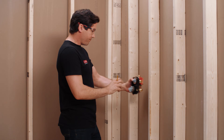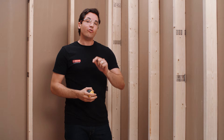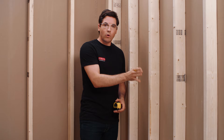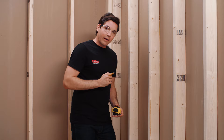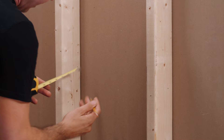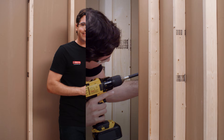So I'm going to have it right around in this stud bay here. Once you get that determined, the next important measurement is where we're going to place our blocking. The important measurement here is 2 and 9/16 inches from finished wall. I've got my rough framing, so you have to think about what other materials are going to be added to get to that finished wall depth. In my case, I'm adding half an inch of cement board and about another half inch of tile and thinset, so my finished wall depth is going to be an inch out from my rough framing. That means I want my mounting block to be an inch and 9/16 inch back from the front of my framing. I'll take my tape measure, measure back about 1 and 9/16 inch, make a little reference line, and repeat the same thing on the other side. Now that I have those positions marked, I'm going to cut a piece of blocking that fits perfectly in between these two studs and then go ahead and screw it in place.